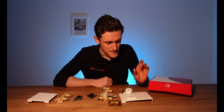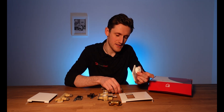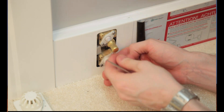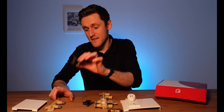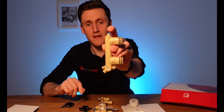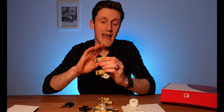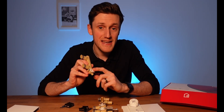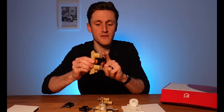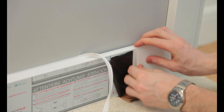The kit also includes the necessary cover plate to conceal the pipework, the valve fascia knob, and the wax element which goes into the TRV valve itself. For the opposite end of the system you have a stainless steel retaining clip which holds in the return manifold. The return manifold has a bleed screw on the top and a drain valve at the bottom, allowing you to get the air out when commissioning the system and drain the water if you ever need to do any servicing or maintenance. The return manifold is also concealed by one of the stainless steel cover plates.